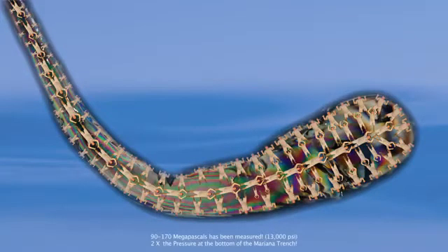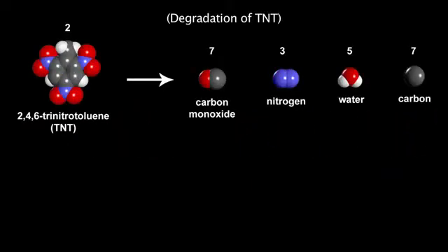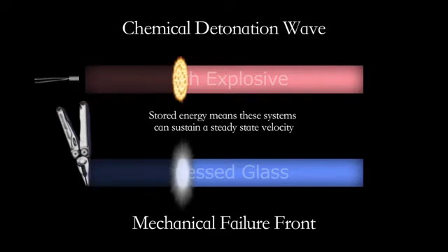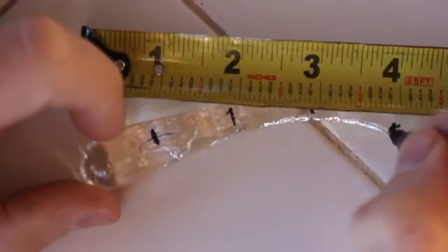The outside is in extremely high compressive stress, and the inside is in extremely high tensile stress. If one link in this tension chain is ever cut, it breaks on down the line, feeding off of its own stored up energy just like a chemical explosive does. The difference is that instead of releasing chemical potential energy, mechanical strain energy is released. This wave of energy is what we call a failure front. You can directly measure the velocity of that failure front as long as you have a camera fast enough. Let's give it a shot at 130,000 frames per second.